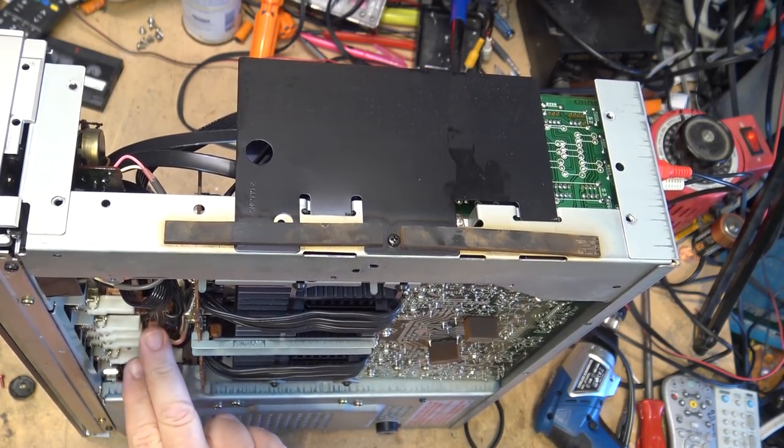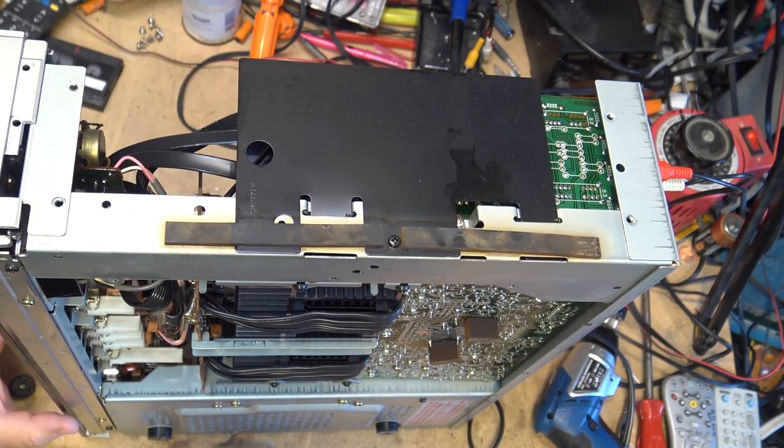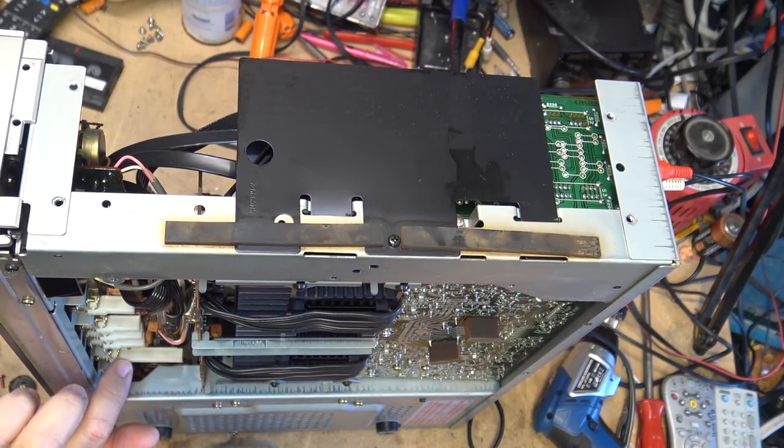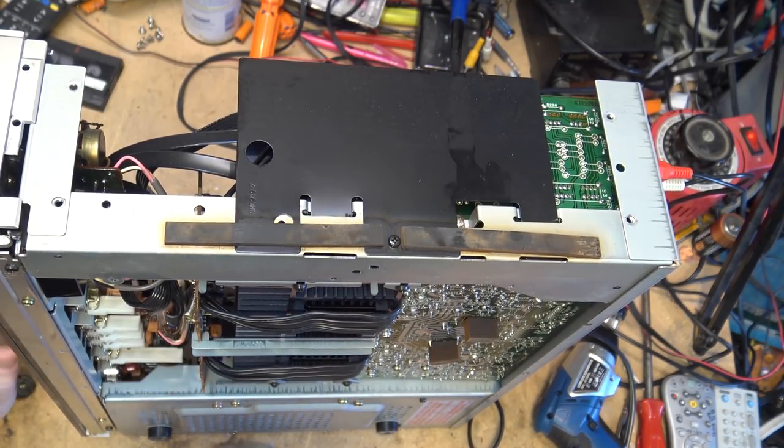Here's our switches and our controls here that I can get at to clean. A couple of the controls here are kind of hidden, but that's okay. I don't think those controls were really dirty. What was, was when I was pressing the switch here. If I can get into this, it looks to be a sealed switch. This could be fun to get into. We'll try getting some contact cleaner into here. See if we can clean up that switch.